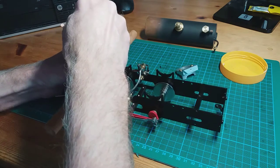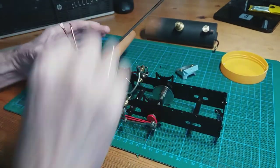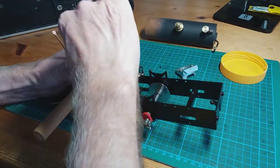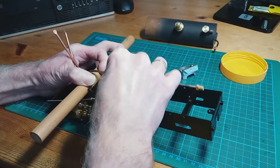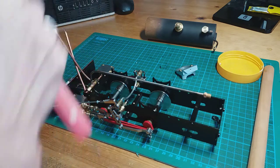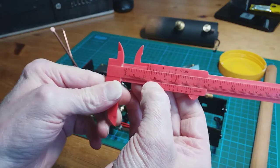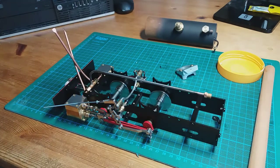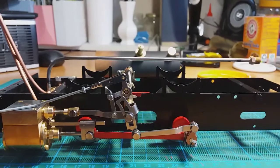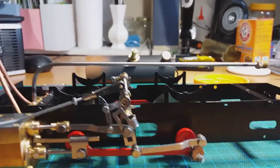Slowly but surely — we've bent it. Let's measure how high it is. It reads just under 25 millimetres, but taking the thickness of the pipe into consideration, we're about 20 millimetres. Looking at whether it's horizontal, it's about right — perhaps dipping a little bit towards the end, but once it's in the boiler flue that should sort itself out.